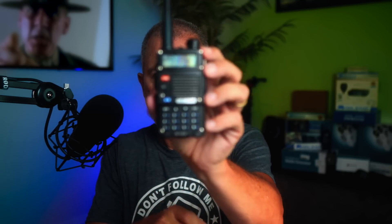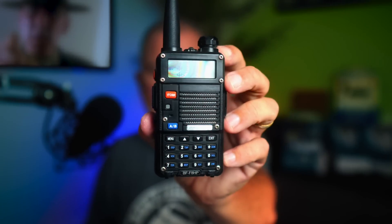That way you can enjoy your day using your radio without having to listen to all the static, and instead only hear your friends talking to you. The issue and the confusion on the Baofeng UV-5R and most modern radios is there is no squelch knob — just volume and on/off — so you have to do it in the programming, and I'm going to show you how. It is actually pretty simple once you get the hang of it.